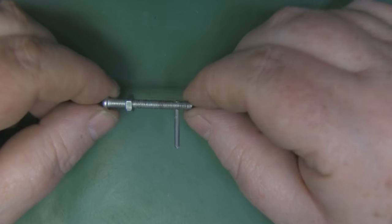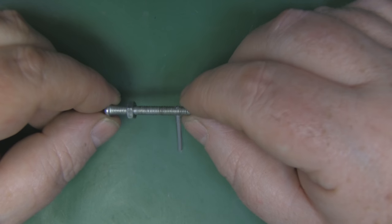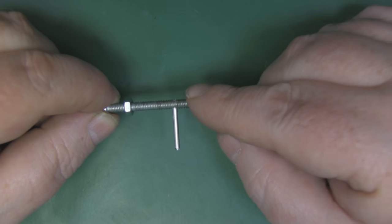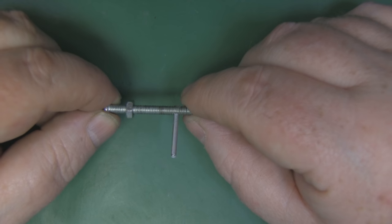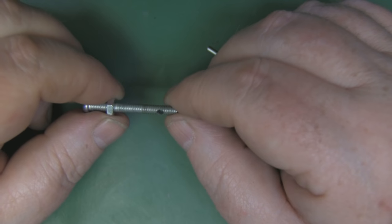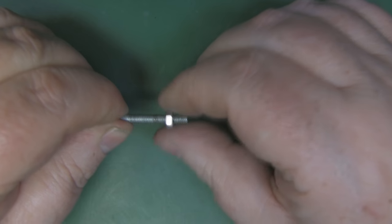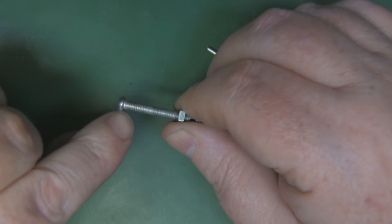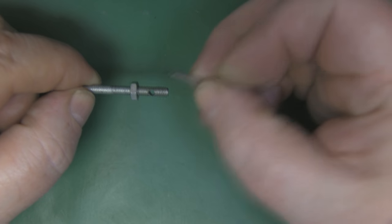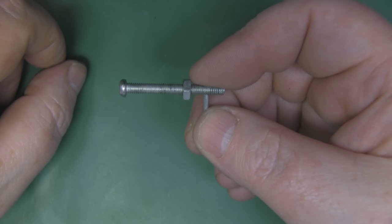The third method is a cheap and cheerful one: simply a nut and bolt. I got a bolt slightly longer than 34 millimeters, cut it down to that length, and drilled a hole all the way through it. The nut placed over the drilled area deburrs it nicely, and you can bolt it straight to the side wall of the waveguide. You can solder the feed wire through the hole and fill it with solder at the top — a really simple approach.